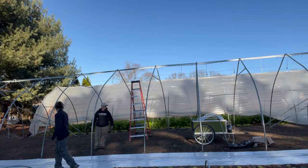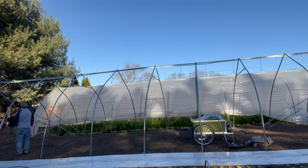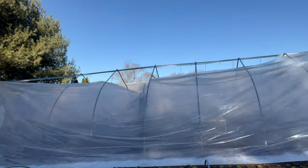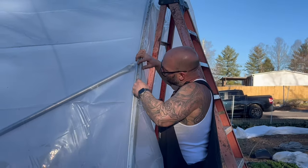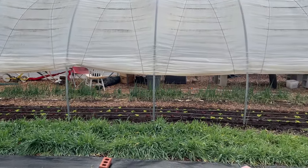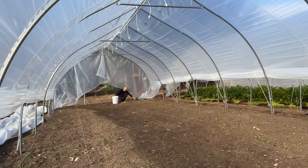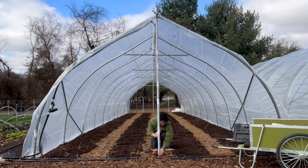The next big step is getting the plastic on. Always be careful that screws, bolts, and any hardware are facing inwards so you don't rip the plastic when installing it. The plastic comes on a roll — we rolled it out to the length we needed, cut it, and the four of us pulled it over the top pretty easily. I used wiggle wire to hold it in place on top while making final adjustments. The plastic is then held down by rope that zigzags down the tunnel, connecting to carabiners at the bottom of each hoop. This secures the plastic so it doesn't flop around in the wind and also allows you to lift up the sides for ventilation. Essentially, the kit is just the bones of the structure and the plastic — the rest is up to you to customize.